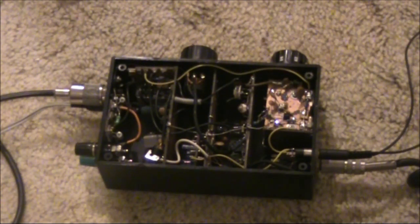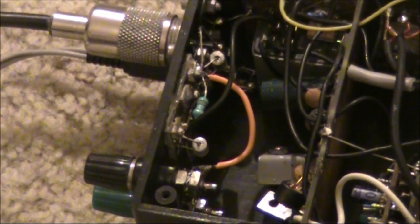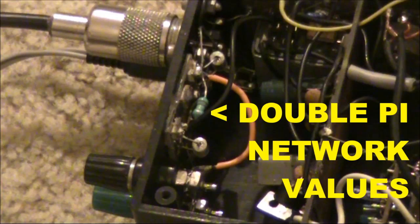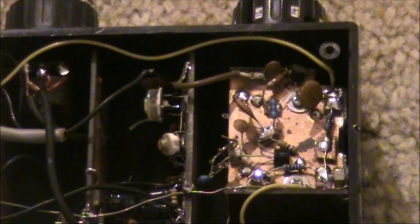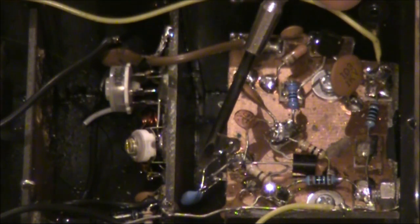The change was very straightforward. The only things I needed to do was to change the output low-pass filter from 7 to 3.5 MHz, and change how the local oscillator generated its signal. Instead of using a 7.2 MHz ceramic resonator, I used a ceramic resonator for 3.68 MHz.